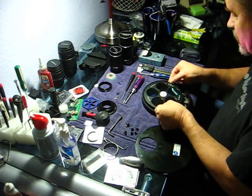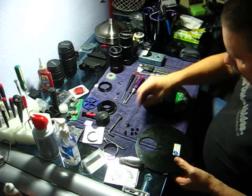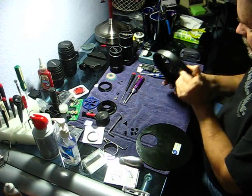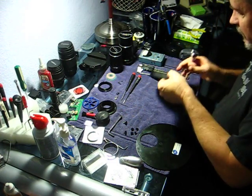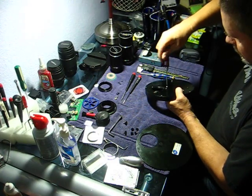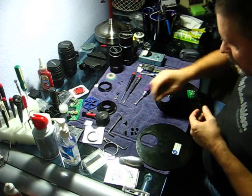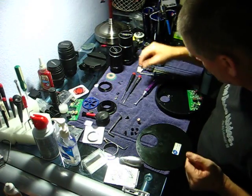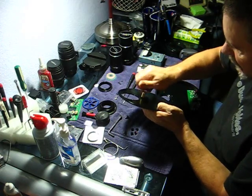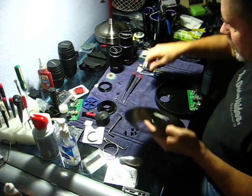I'm going to remove the filters and set them aside for a moment. The screw inside just doesn't work here, but there's a really easy solution. If you turn this over, you'll see that the screw holding the brass post or axle can be removed and reinstalled using this alternative screw instead. One difference is that this has to be assembled first, so the reconstruction of the filter wheel will be slightly different from how we originally disassembled it.